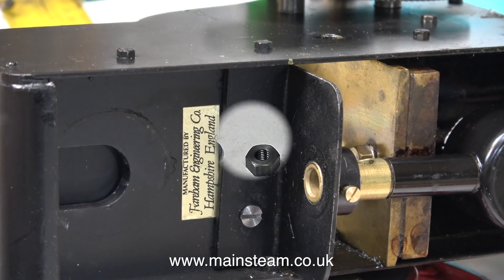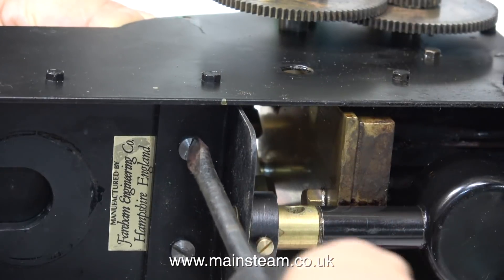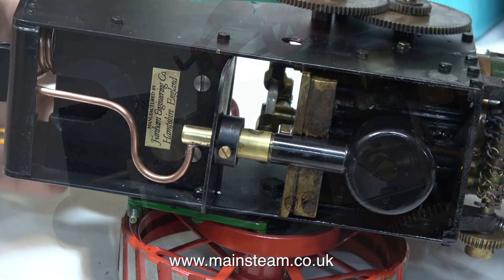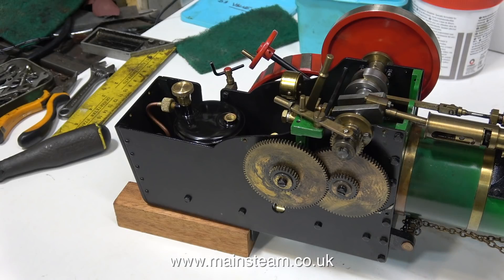It's time now to fit the entire assembly to the traction engine, and for this I'm using a pair of 2BA bolts with washers and nuts. And when I fit the gas jet assembly, it looks like this. Just in case you're wondering why there is a coil in the gas jet pipe — I'd love to say something technical about strain relief, but really it was because this commercial item, the gas pipe and the fittings, was too long. So there you have it — the Marky Traction Engine is now a gas fired Marky Traction Engine. I'll be giving it a steam test in the next episode. Thanks for watching, and I hope you found it useful.